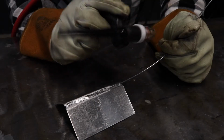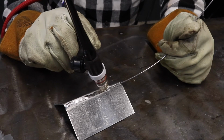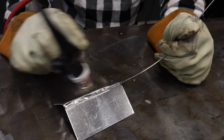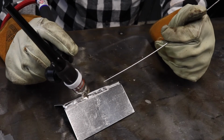So with lay wire, I got into a good groove here. I was a little bit off here because I was trying to avoid the camera. All lay wire is getting the filler rod on an angle like this, so you're just putting tension here. And when you're welding, you're essentially just running it over, and you'll watch it actually fall into it. So from here to here, you can see that it was a good lay wire technique.